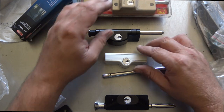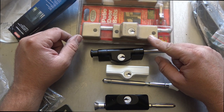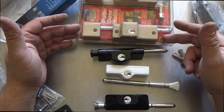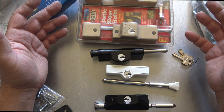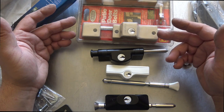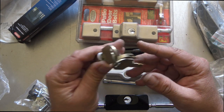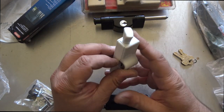With these bolts, only the Lockwood 680 is really compatible with restricted keying. So if you need restricted keying on a house and need to fit patio bolts, you'd likely have to go for the 680 — they're more expensive, not great to fit, but you can get a cylinder plug for the back for restricted keying. Until now.